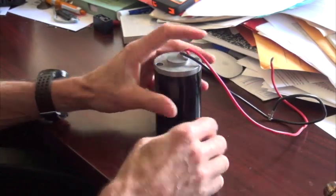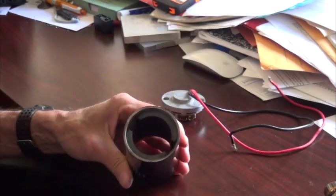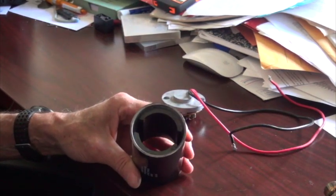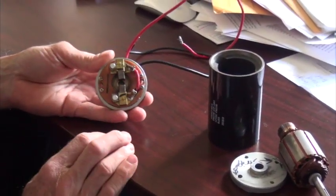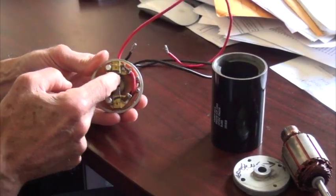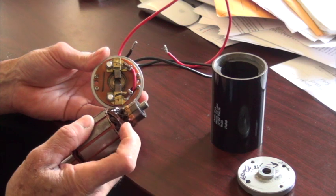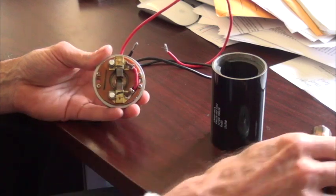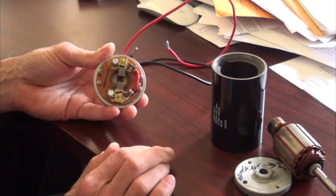The reason why the rotor is forced to spin is because of these huge permanent magnets — hence the name brushed permanent magnet motors. These will be a north on one side and a south on the other, and interacting with electromagnets causes the torque. The clever part that makes it a brushed motor are these two electrical contacts made out of graphite or carbon. These engage on the commutator to switch the voltage and current through the wires. They do some clever stuff, but they're also the reason why brushed DC motors do wear out — these brushes will eventually wear out and make a little bit of a mess.